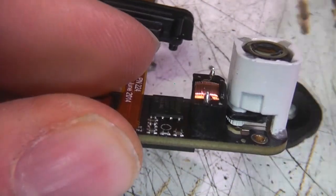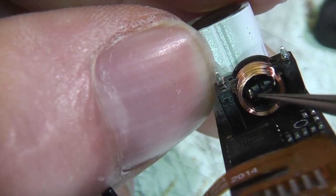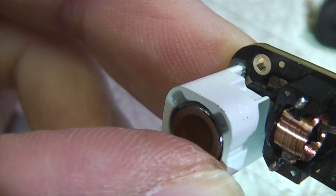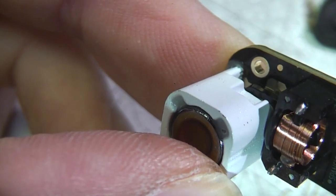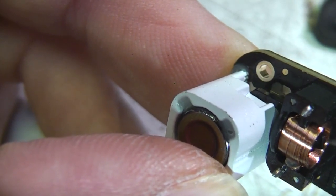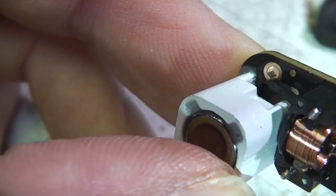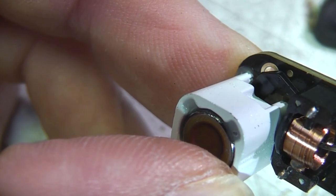See in here there's a plastic rotor with a couple of magnets on it, so that's going to be moved by the magnetic field from that coil to flip this shutter. And this looks like it's powered to move it up. I'm guessing there's maybe a hole in it, because I wouldn't expect it to need power to actually be open. So I'm guessing there's probably a hole in that vane. So that's the straight through, and then that's the calibration position when it lifts it up.